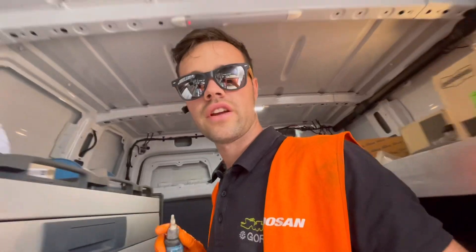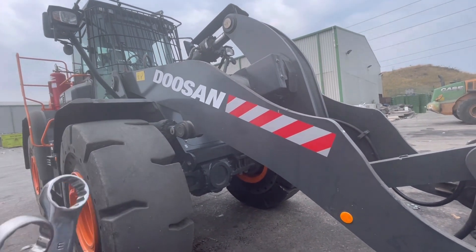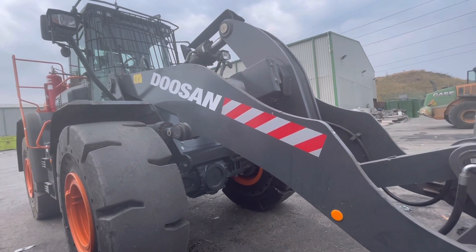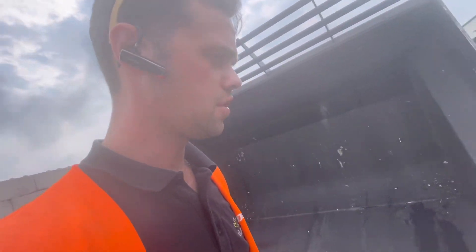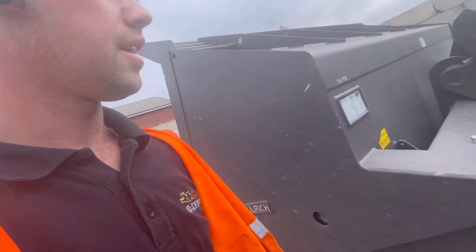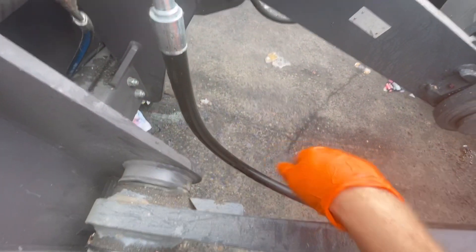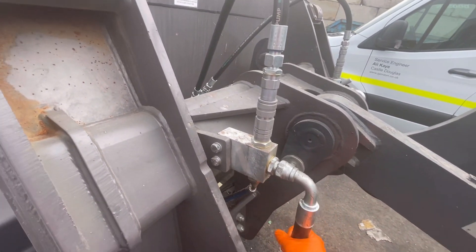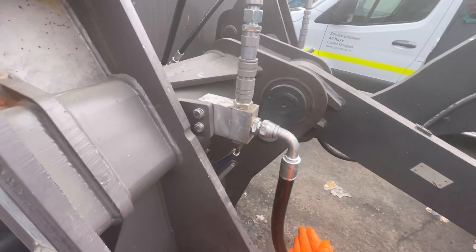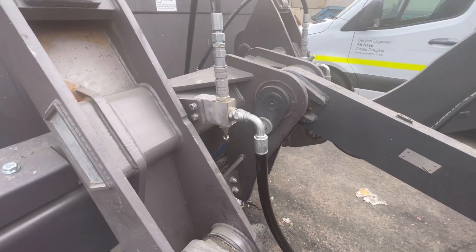I'll try this thread sealant and see how we go. With both adapters taken off, I've sealed up the threads with some hydraulic thread sealant, so hopefully that'll keep the machine going for the time being. I've just noticed another oil leak on it — I would imagine this pipe was just knocked when I was working it. I noticed it was damp, and having had a look it's just a bit loose, probably been knocked. So I'll give that a good tighten up — one less job to do another day.